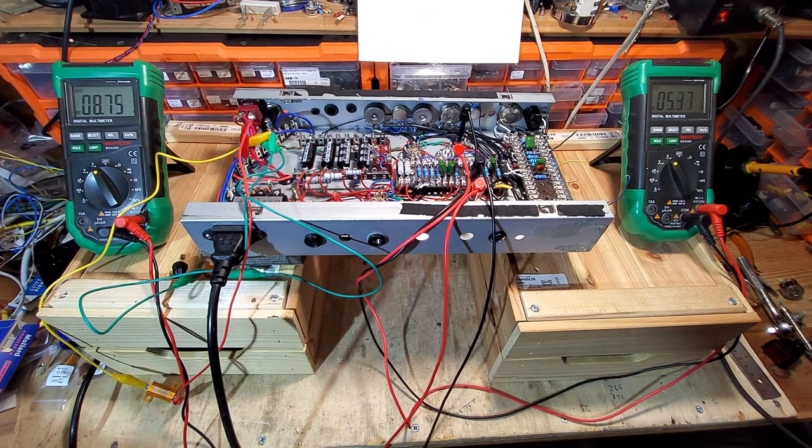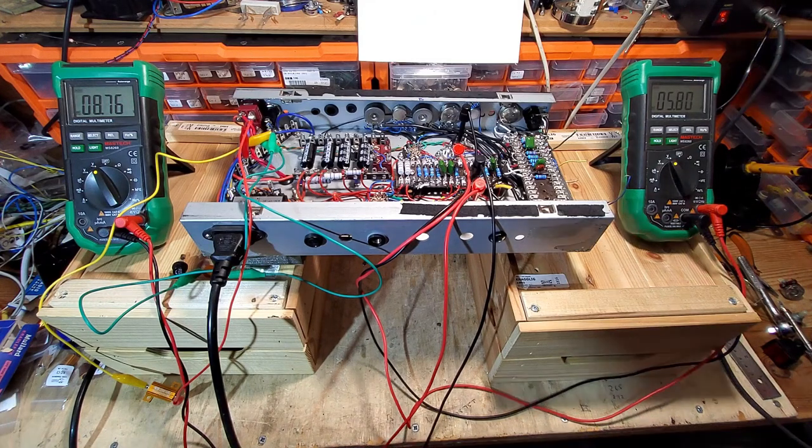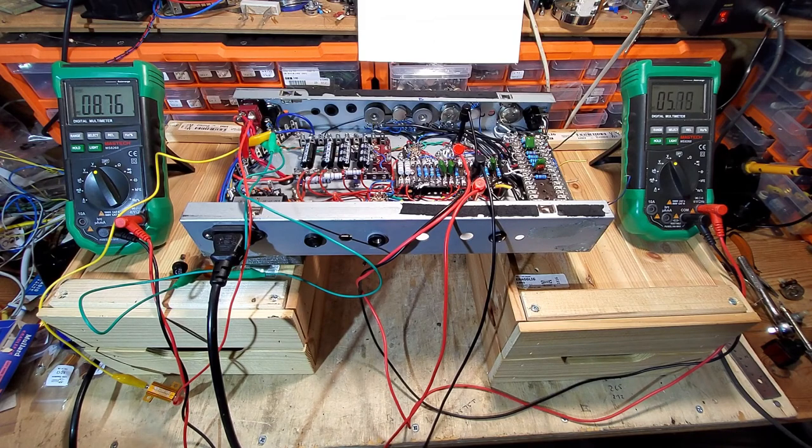Now there's one or two issues with this, which is why we're using these resistors. One is that this transformer is 220 volts in, as most of them are now that you find. So we'll be running 235 into it, so we're already 15 volts over. The transformer is 2.2 amps, and I'd have been better off with a slightly smaller one, 30 watts rather than 40. I got a 21 watt one that came out at 1.1 amps, and that was too small really. So we've got 1.2 on these, because each of these tubes draws 300 milliamps and we've got 4, so 1.2 amps.